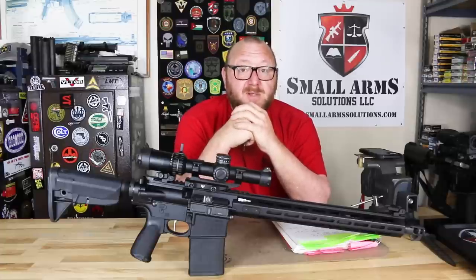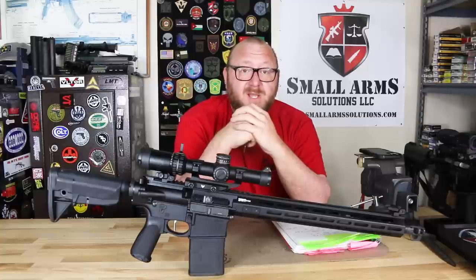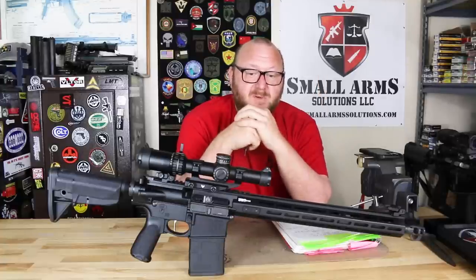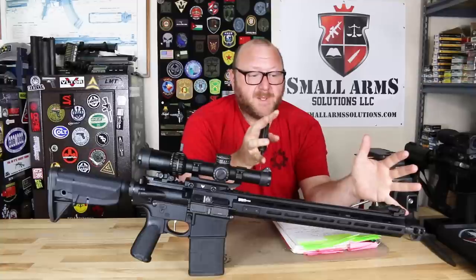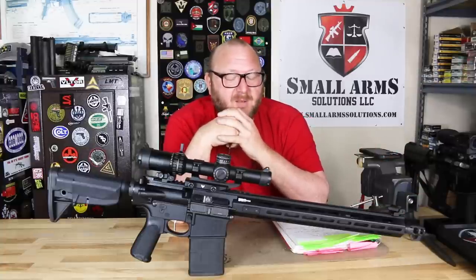You're also starting to see in this industry a lot of movement away from the carbine length gas systems on anything from the 14.5-inch forward. You're seeing them go with the mid-length gas systems. Pretty much, if you're under that, at 10.5-inch or 11.5-inch, you're staying with the carbine length. But pretty much everything else, the industry's finally seen the light that the mid-length gas system is the way to go.